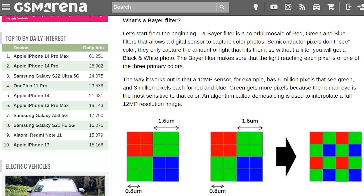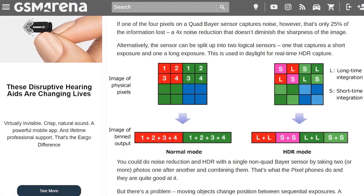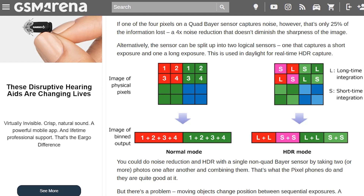So what's the difference? I'm going to try to keep this brief and not too technical, but when you're looking at a Bayer filter, you have the RGB pixels there — you get two pixels for green because eyes are more sensitive to green, and you're going to get one pixel for red and one pixel for blue. So that's a total of four pixels. Now on a quad Bayer sensor, instead of one pixel for red you're going to get four, instead of one for blue you're going to get four, and instead of two for green you're going to get eight. So it's quadrupling — giving you more photo sites to work with when it comes to capturing your images.